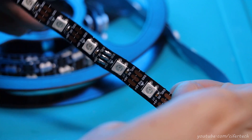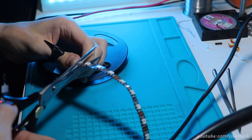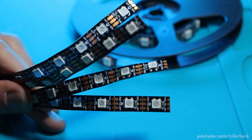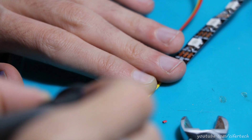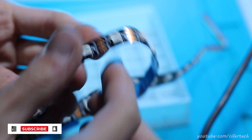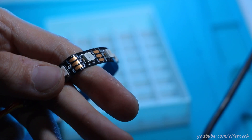For our second matrix display, I simply used a WS2812B NeoPixel strip. The NeoPixel type is the same as the module I previously used. These NeoPixels are addressable, which is great for our project. There are 4 different pins in these strip lights, which allow us to power it with 5V and also enable communication between the NeoPixel and microcontroller using DIN, or DATA input.